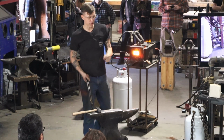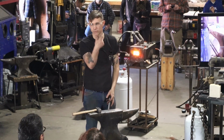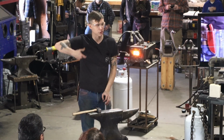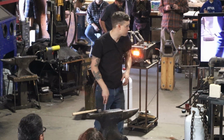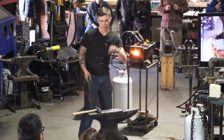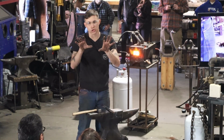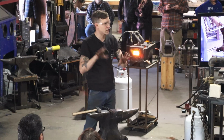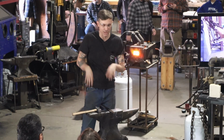And then I actually, on a lot of my sabers and stuff, I keep that little finger choil. People like it. It's a good balance point. I was just going to mash that out, but I might not do it. But I need to tune that up just to make sure I have the right angle for a cutting board. Because that's one thing: while it's hot, you can crank and completely change where that steel is, right? If you let it cool down, you'll never grind it up. You can only take stuff off of one side.